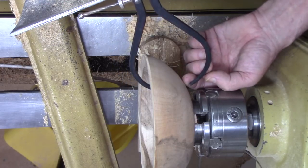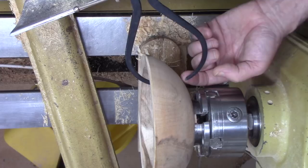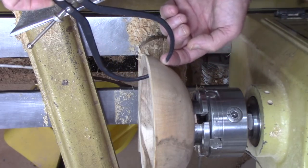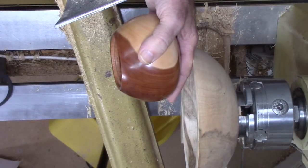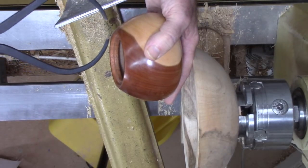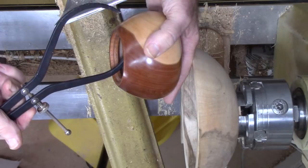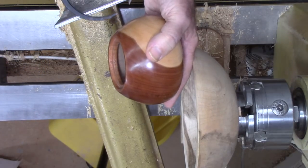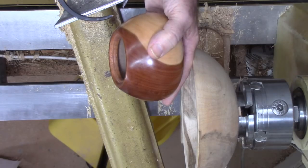Again, keep it 90 degrees to the surface so you'll get an accurate measurement. And this will give you a real good idea whether it's getting thicker or thinner. Now, this same technique will work on a small hollow form or a large box like this. Now, in this case, it's a lot thinner, so let's adjust it to something smaller,